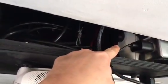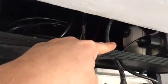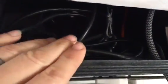So I told you how the Wemo switch over here supplies power to the projector, but actually I have it plugged into a power strip, and it's kind of dark in there. The power strip is back there, okay? And what I actually have it power is the projector and also an AC/DC converter for 12 volts. So that way when that powers on, not only does it turn on the projector, but it sends the 12-volt trigger to the linear actuator, which pulls and lets down the projector.